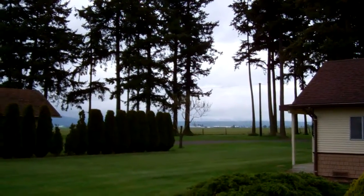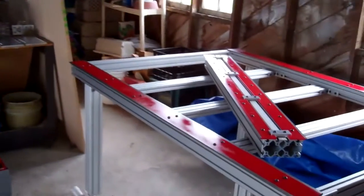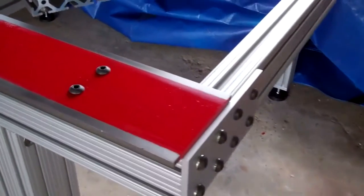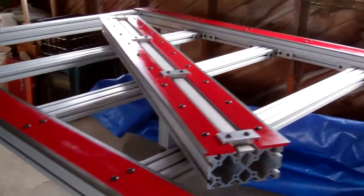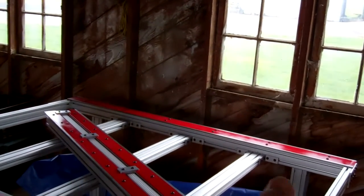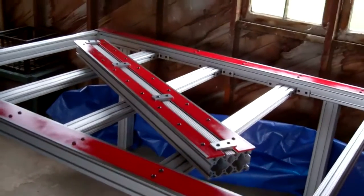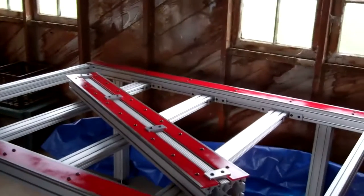Here we have a much more typical day for Bayview. I'm back in the garage working on the router, and today I've got the x-axis rails mounted so they look alright. I haven't tightened them down yet — I'm going to need to get one of them centered perfectly and tighten it down, and leave the other one floating until I get the gantry done, then run the thing back and forth.